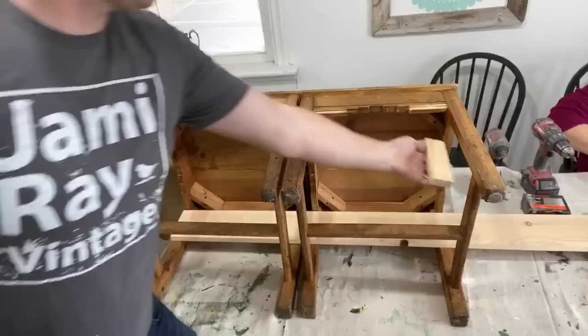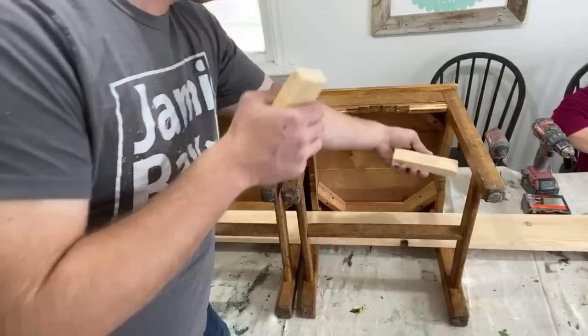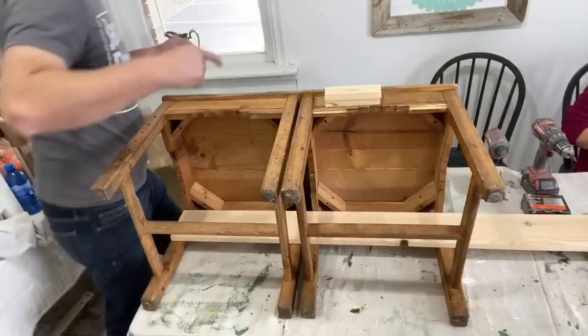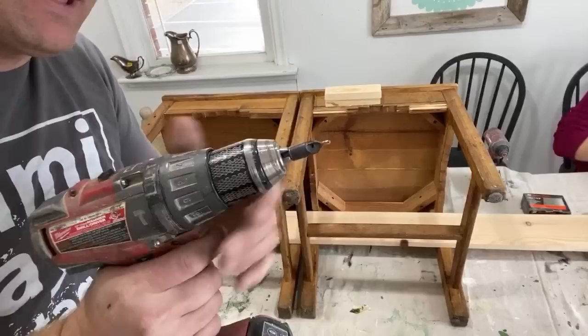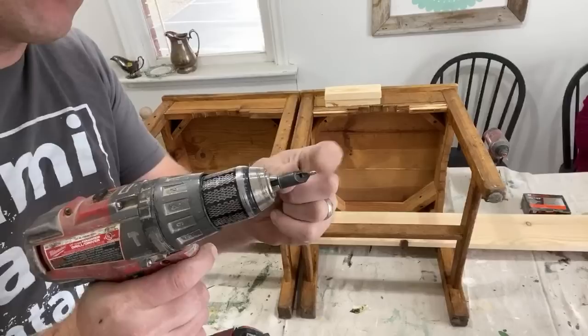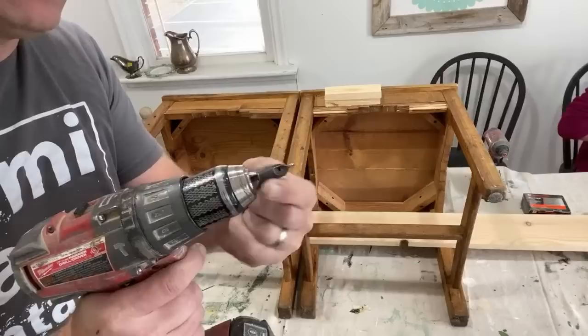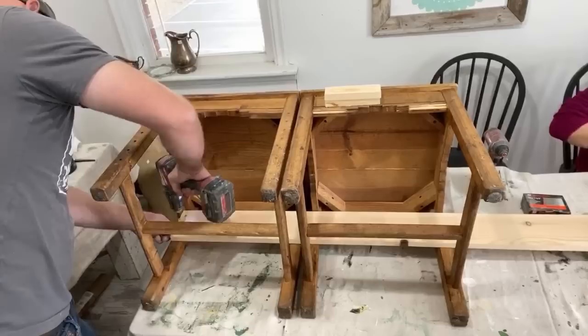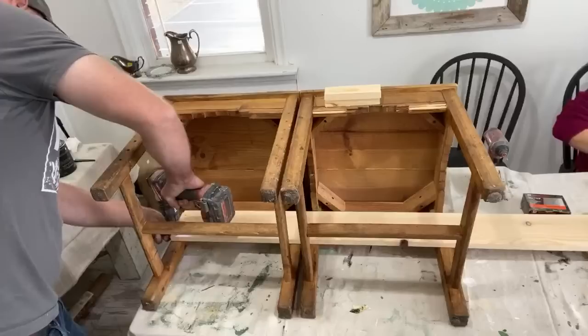When I add that third chair, we'll put it over here like this. I may go sideways and cut the edge off — I missed my cuts a little bit; they were supposed to be a little wider but I didn't have my saw with me this morning. I'm going to run some countersink holes. This is my countersink bit — mine usually break off and once they break off I resharpen them. I've got a little belt grinder I use to resharpen those and then I just use the little nub. I'm just going to countersink a hole here just enough so that the screw head can sit down in there and we can fill it later with some wood putty or lightweight spackle.